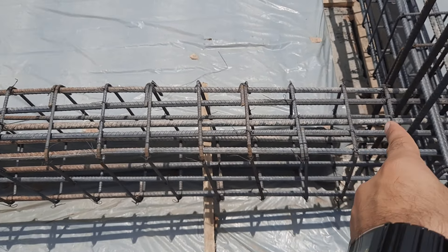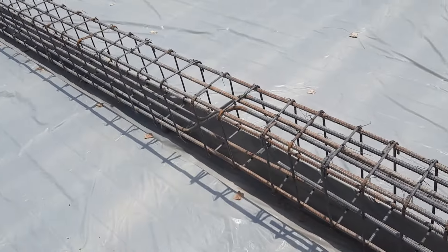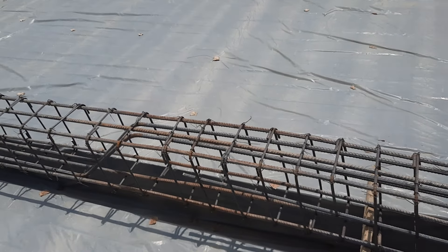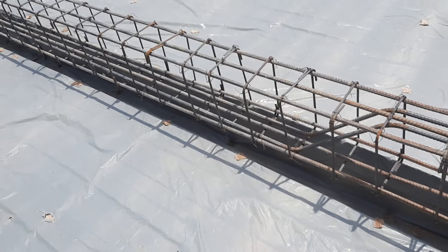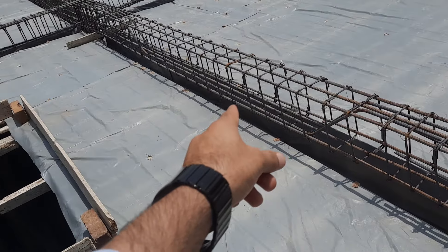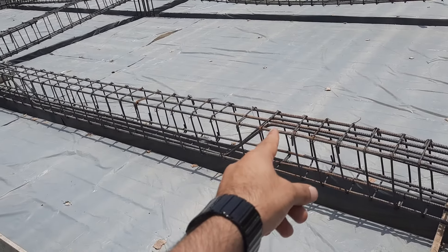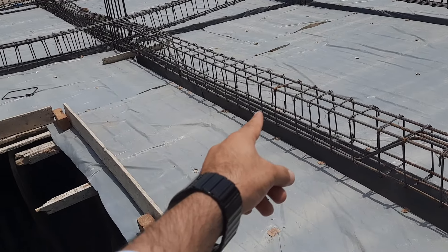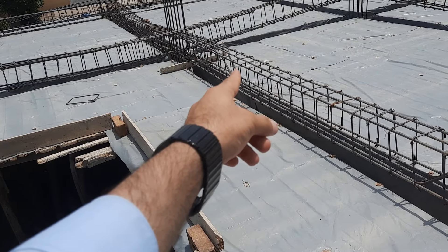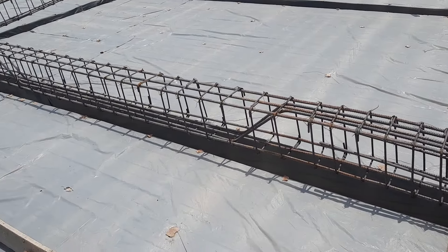At this place they should provide a minimum spacing of about 75 millimeters, especially for a commercial building with a 20-foot span. The stirrups should be provided closely near the supports. To summarize: the total distance is 20 feet, crank bars are provided for five feet from each end, and in the middle 10 feet the bars are at the standard arrangement, then again the steel is bent for five feet on the other side.